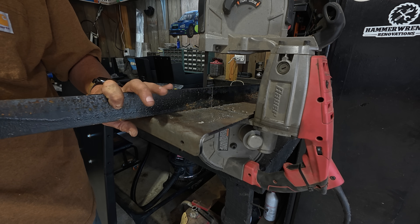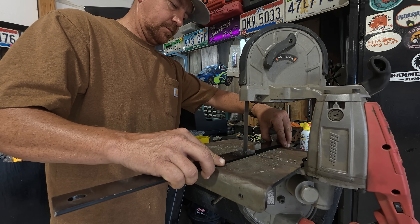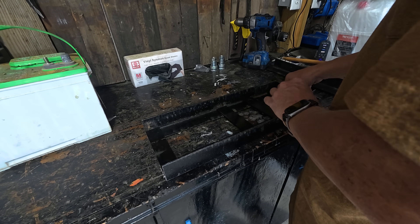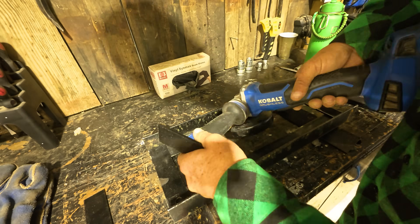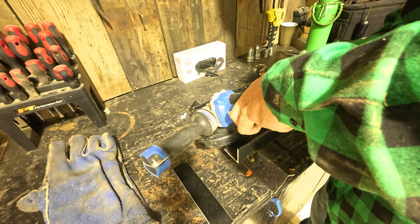I just happened to have an extra deep cycle battery around that is good, so I decided that would be great for this project. I welded together these pieces of metal on that tray and built some uprights so that we could bolt the hydraulic pump solid to the whole setup — that way it doesn't get jarred around or broken if it's laying loose. I wanted to build an all-in-one unit that I can just pick up and set in the bed of my side-by-side, and when I'm done I can pick it out and set it aside. It ends up being a pretty heavy piece — if you use a big deep cycle battery those are not light, and neither is this pump. The whole setup probably weighs 75 to 100 pounds, but it's manageable and it works great.